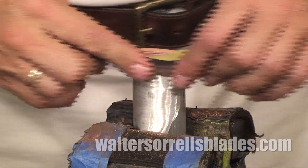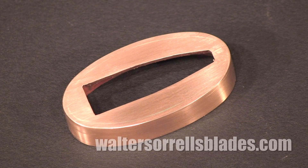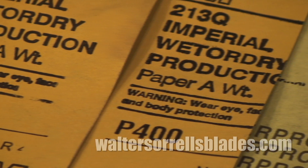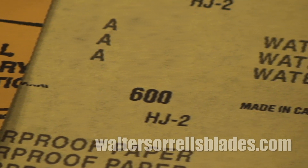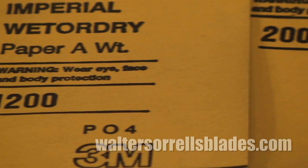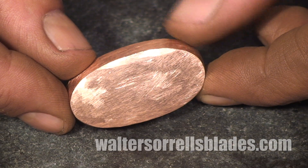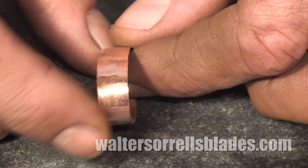The main purpose of sandpaper is to give material a smooth, pleasing appearance. Start with a grit heavy enough to remove the scratches made by whatever tool you used to shape the part, then move up through the grit sizes to whatever your target finish is. If you want a matte finish, 400 to 600 grit will be plenty. If you want a brighter, shinier finish, you may want to go up to somewhere between 1000 and 2500. The key is to get rid of every single scratch from the previous grit before you move to the next.